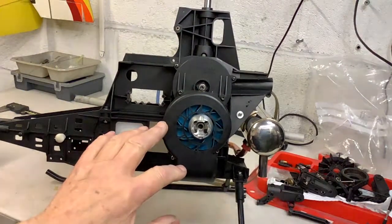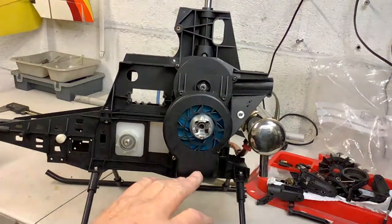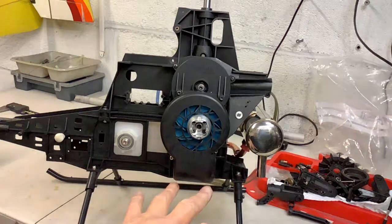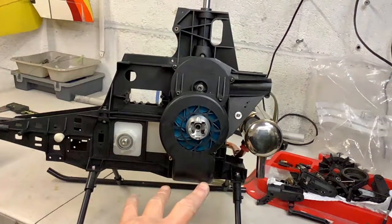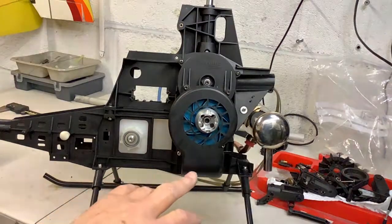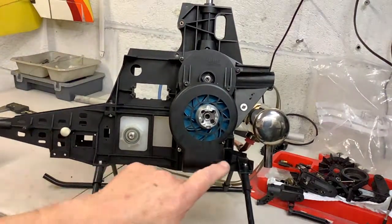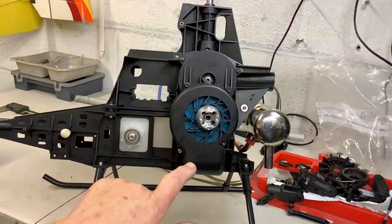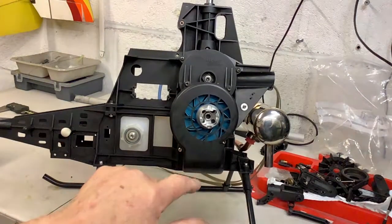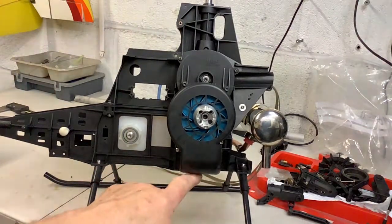We've got the alley fan in there, I'm hoping that that's going to be enough cooling. I've got a shroud. A mate of mine made me up a shroud because the shroud that went in there was, I think, to aid the cooling, because I think it overheat, and it was made of stainless steel. It was really heavy, so I got a mate of mine to make me up a nice alley one. It don't weigh nothing, but I was looking at it last night, and it actually blocks off half of this here, and it directs the air just onto the barrel. Now I know that's good, but it was blocking this off completely. It was like 20 mil, something like that.